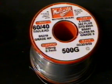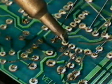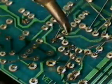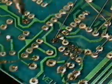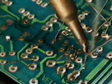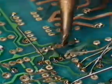For the majority of modern miniature circuit boards, you will find it easy to use the finer 22 SWG solder rather than the thicker 18 SWG type. To make the soldered joint, apply the tip face directly to the exact point where the lead and the pad touch, and apply the solder at the same time, feeding it in as it melts. Remove the iron and the solder as soon as the solder flows freely around the pad and component lead.